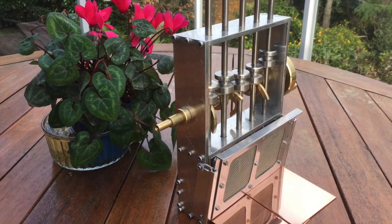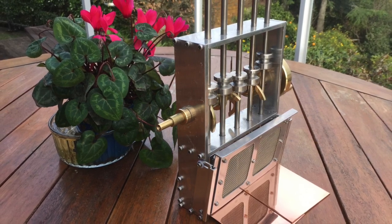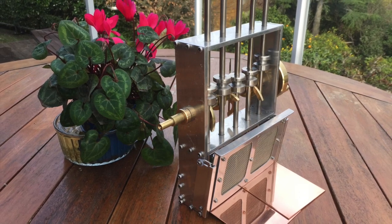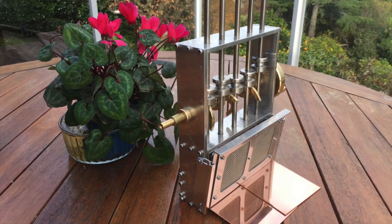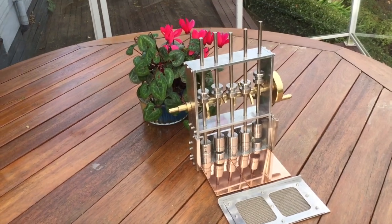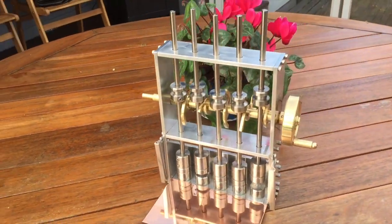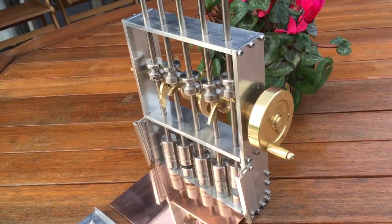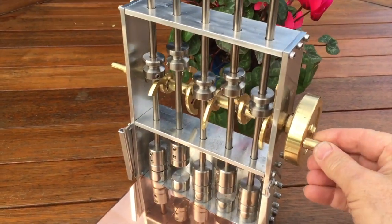In front of the stamper we see some copper plates — well, actually they were Muntz metal. It's a kind of brass named after Mr. Muntz who patented it for naval use. It's 60% copper, 39% zinc, and about 1% iron. They used this metal because mercury would stick to it, and as they washed the powdered quartz and gold mixture over these plates, the gold would stick to the mercury and form an amalgam — an alloy similar to what they used for dental fillings.